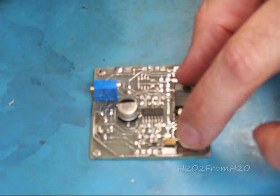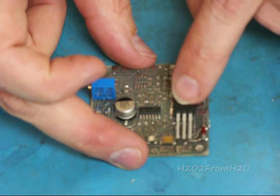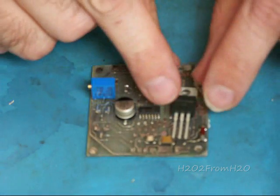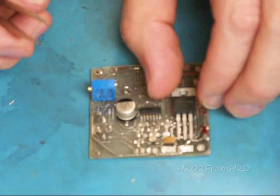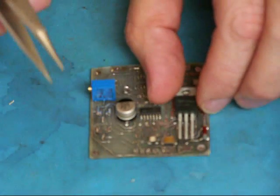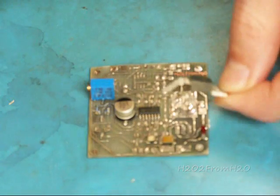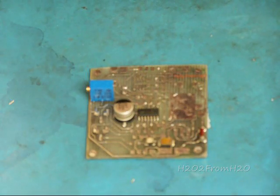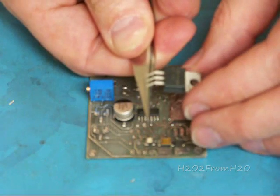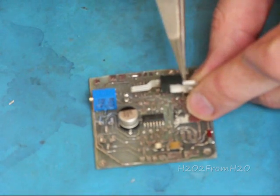This hook component is actually a through-hole component and we're going to make it fit and solder it down to the board. We have to bend those legs — curve them down and then out. Right at the junction where they start to get thin, where they would normally go through the through holes, I'm going to bend that at about a 45-degree angle, and then bend it again where it would come flat to the table. So now this flat part here is equal to that flat part that comes straight across.